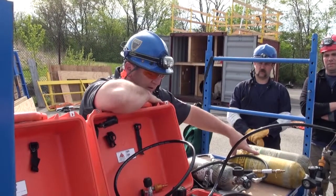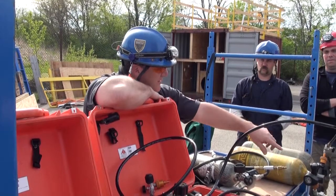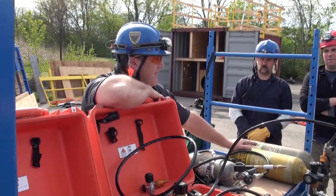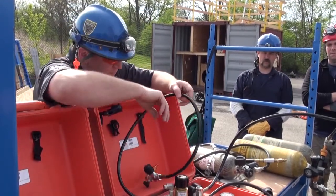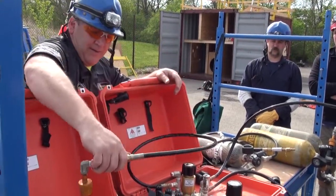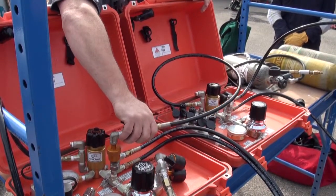That's why we only use one bottle — we have a backup. When the low air alarm goes off, we turn the other bottle on, turn this one off, open the bleeder valve, and change the bottle. In order to charge the second system, this pigtail is going to go right in the middle. Go ahead and hook that up.